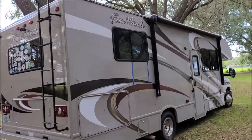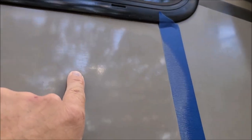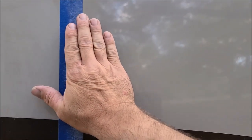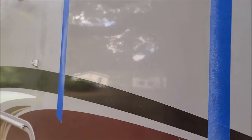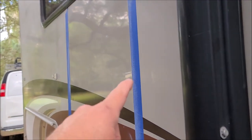Boom — see how glossy this back end is compared to the chalkiness over here. I did another test. See how hazy it is in here? That's the glue. But in here you see all those streaks, and you don't down here. What happened was I removed the glue from just this bottom section and left it on the top, and I compounded the whole thing. When I'm using my gel coat oxidation eater — which is what I'm using on this — it's pretty aggressive stuff. I'll do between three and five passes for a section, and you can see that it left all that behind. So I would have to go over it over and over, versus just hitting it one time after cleaning the glue, and you've got that immaculate clarity right there.